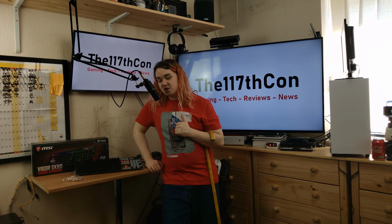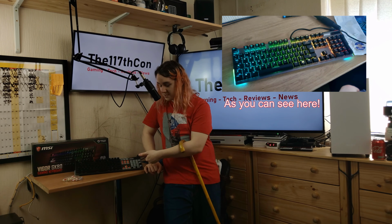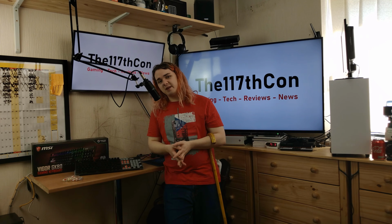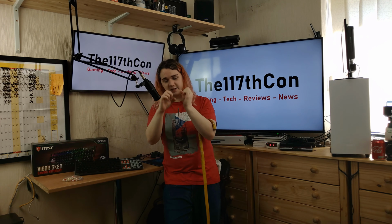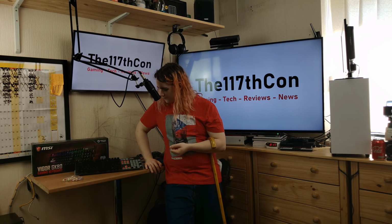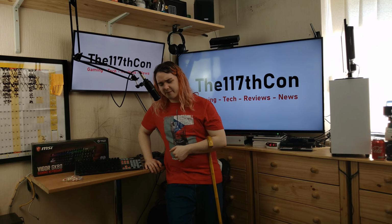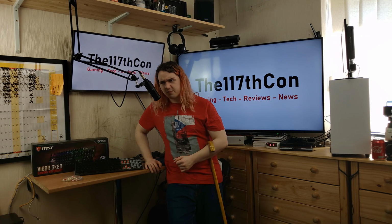So one, I melted the hell out of the key switch. Two, I nearly melted the hell out of an LED. I think it was that one up there. It does work, I've just got the lights off because it makes it easier to see the blues and the reds. So I nearly destroyed an LED. And on top of that, trying to remove the switch that had melted was a bit of a pain because it sort of became a rivet in the fact that it melted the top. That top expanded out, and now I'm trying to fit something that is that big for a hole that's that big. That didn't go well. But once I got used to that, it worked out pretty well. And well, I'm going to go ahead and roll the footage right about here on how that turned out. The entire, well, most of the process, because I forgot to hit record a couple of times, so sorry about that. But we've got most of the process recorded down for you.